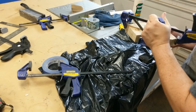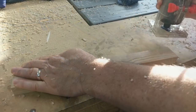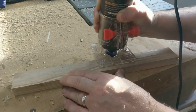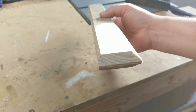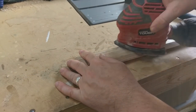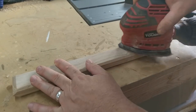I built a second form for the laminated glue up so I could utilize the small amount of clamps that I did have. And while that glue dried, I returned to that ash piece and put a small chamfer on the top edge and a larger chamfer on the bottom edge. After sanding it down, it was ready for some finish.